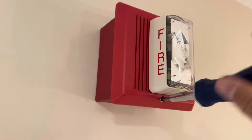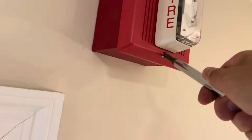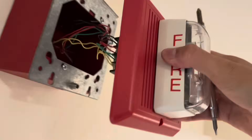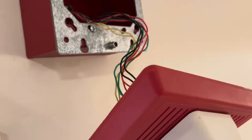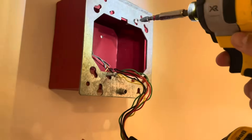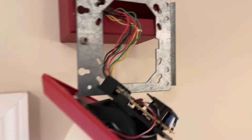These all have a tiny little screw at the bottom — and I don't know why this is flathead, it's really annoying. You just remove this screw and then this thing pops off the mounting base. Once you pull the device off the bracket, you'll see the wires are folded pretty nicely. I always try to make a little arc so that when you push the wires into the box, especially when there's this many, none of the wires get creased and break. Now we have to remove the mounting bracket. I wish I had a drill.